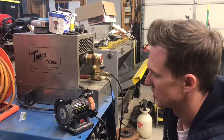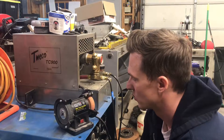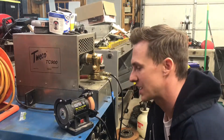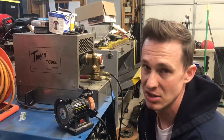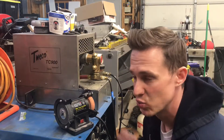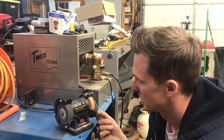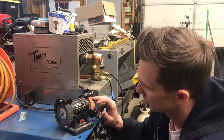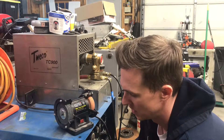Every so often I've got to come down and knock down the ridges so I can get a fresh surface to grind to — it's really just a bad habit, not a negative side effect, just adds a little extra wear and tear. For myself it might take actually getting a Dremel dedicated for grinding tungsten. The only reason I haven't is that it's one extra tool to chuck up. It's quick and easy to just hold it by hand, and because of the grit on these two wheels I actually get a really high quality result from a sharpening and polishing standpoint.